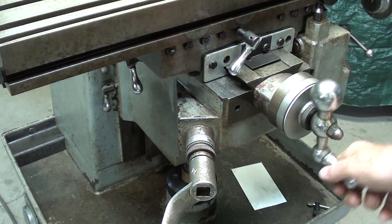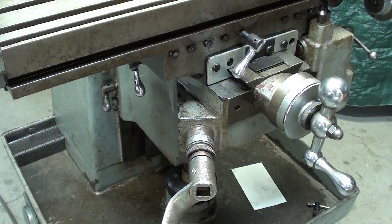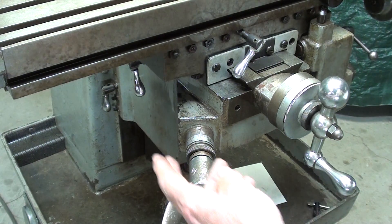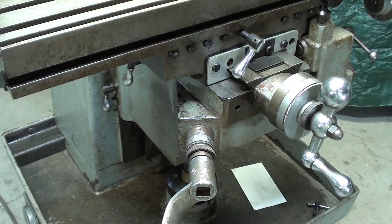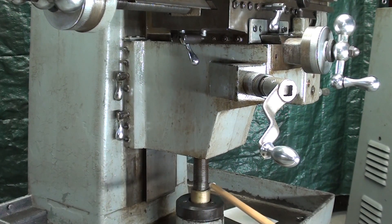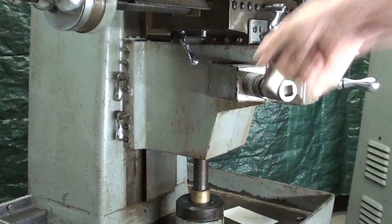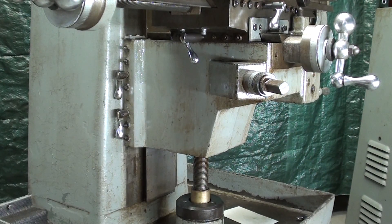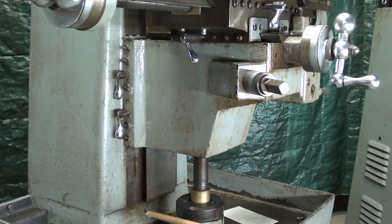The table can be moved in and out — that is traversed in and out — and that is the Y-axis. Sometimes I call that the cross feed, although that might be a term more applicable to the lathe. And right under here is a lock so that we can lock it so there is no movement in the Y-axis. Again, this is the knee, and it's raised and lowered — that's the Z-axis — raised and lowered by this screw called the knee lift screw. We move it in the vertical direction with this hand crank. That can be taken off also to get it out of your way, and there are two locks right here that will lock the knee in position. And of course that's the dovetail there on which the knee rides and is located very accurately.